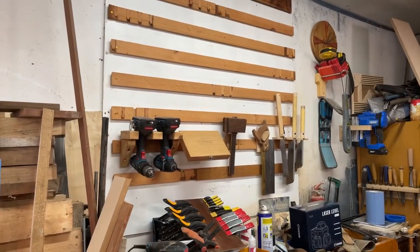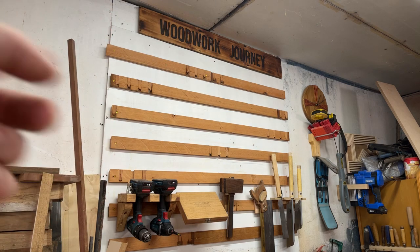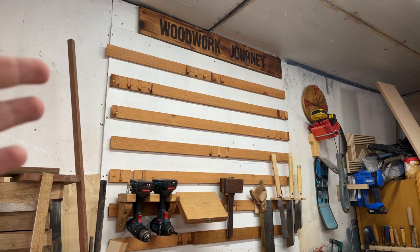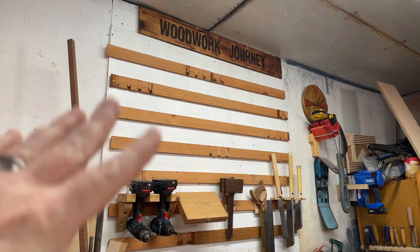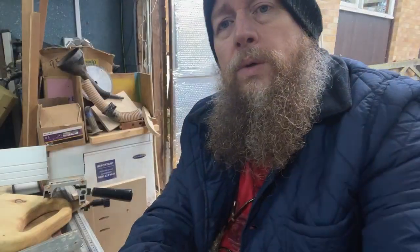So what's going on in the workshop the rest of the time - like I showed you at the start, I've put some French cleats up which were actually parts of an old 1930s door. They are Douglas fir and I just ripped them down and they're up there now. I didn't video doing it because all I did was rip down pieces of wood, put a 45-degree cut with the table saw along the top of each one - and that was that. They're all about 15-16mm out from the wall; I would prefer 18mm but it is what it is.